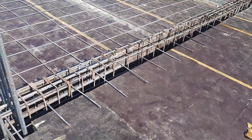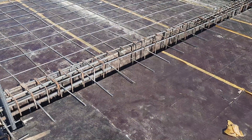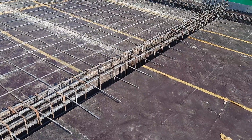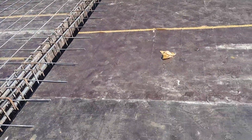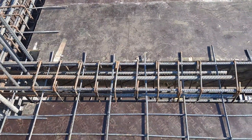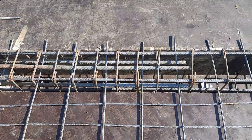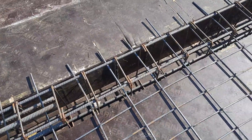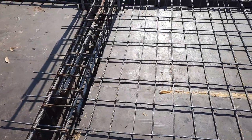The second technical mistake: you can see again inside this floor beam they placed the steel reinforcement of the RCC slab, but they will provide lapping again on the other side as well. So here we have more than 30 percent lapping in the construction of this RCC slab with floor beam.